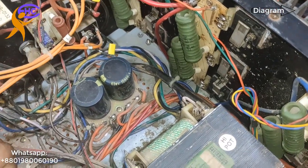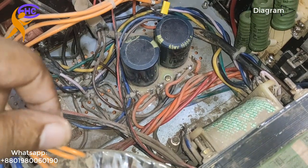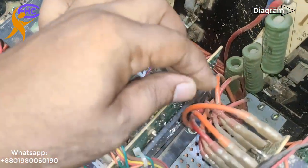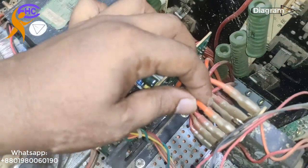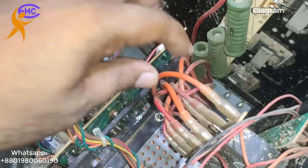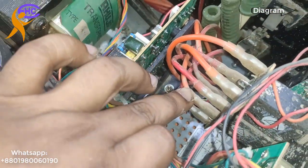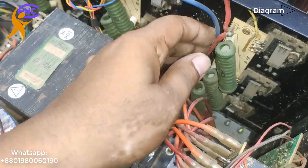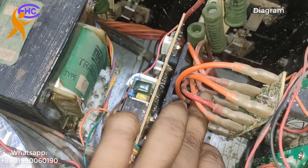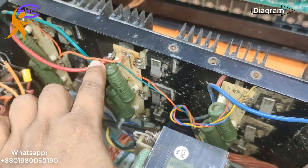Look, the orange color wire has got voltage — positive voltage. The orange color wire got positive voltage. This orange color wire comes to the second breaker. The first one is for the A-side and the second one is for the B-side. The two orange color wires come from the capacitor, and the red color wire is the output.